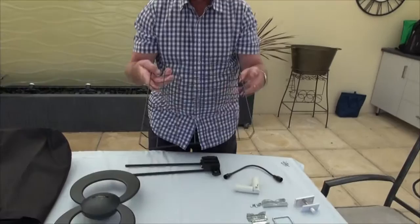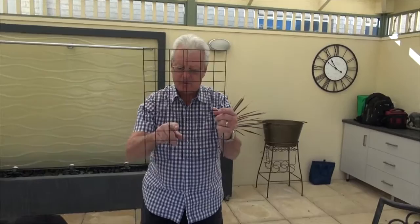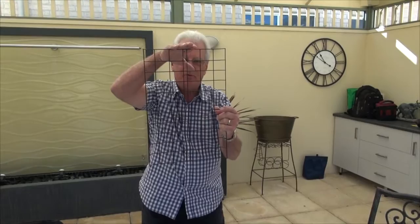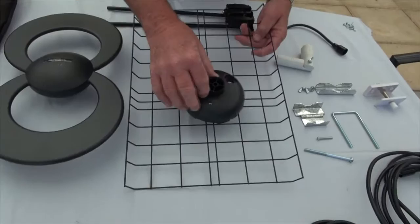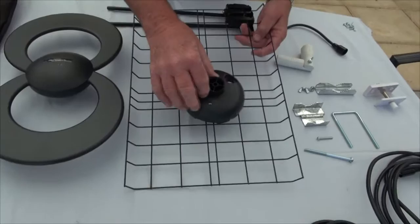When you get the antenna laid out, you'll notice that this is the reflector. It has six squares at the top side and four at the bottom, with rectangulars in the middle. It's designed that way so this is the top of the antenna — so when I refer to the top, this is the top and that's the bottom obviously. The first thing you do is get that part with the edges sitting up and lay this over the squares with the hole to the top.